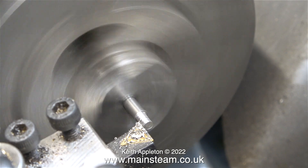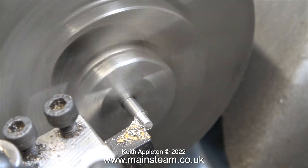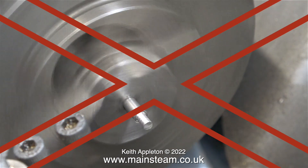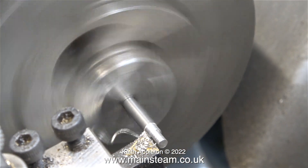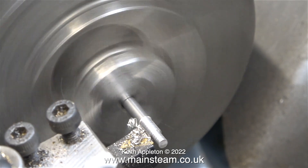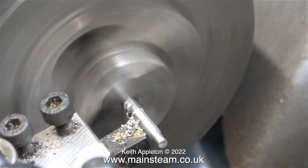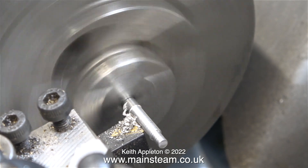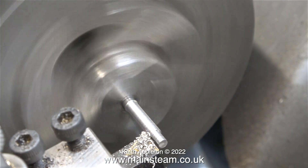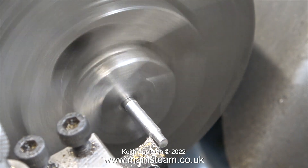Traditionally the handle of a water valve for an injector goes all the way through the main shaft. The problem is the part that I need to turn down needs to be a lot longer than you see here, so I pulled it out from the chuck to show why you shouldn't do this. This is only three sixteenths of an inch in diameter and what happens is near the end furthest from the chuck it's just pushing away from the tool, and as I further reduce the diameter the pushing away from the tool gets even worse.